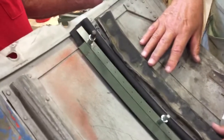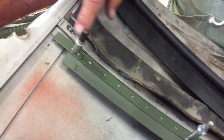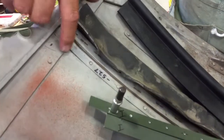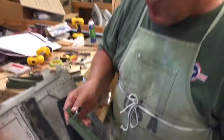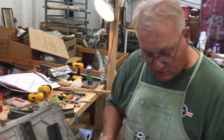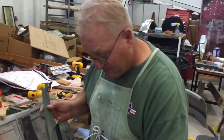The joggle was there because of where the rivet location is. Because of our rivet location being an inch apart, you require a joggle to go up over this outer part. Where their rivet location is two and a half inches apart, you don't need a joggle. I think the closer spacing looks better and seems like it'll seal better, but who knows.